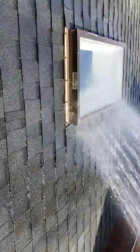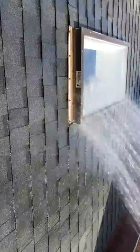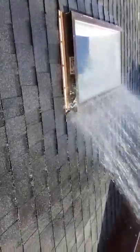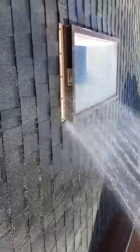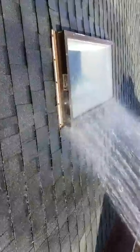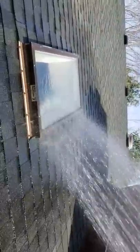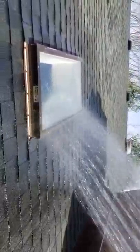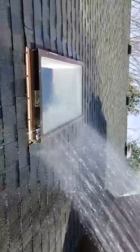So now I'm working on the right side. I've been here for about four or five minutes on this right side hitting it, and if I can't get it to leak on either the bottom or the right side, then I'll go up to the very top of the skylight and see if we can get it to show. This is a substantial amount of water — more than you would normally get in the rain, and I'm blasting it against the shingles, so if the skylight can defend this it's pretty safe.